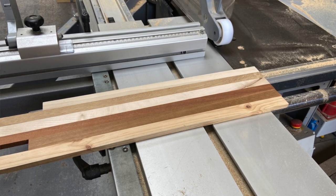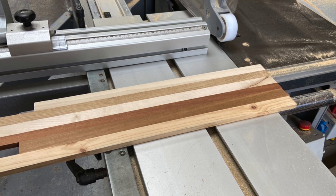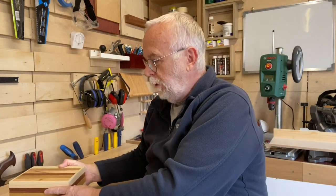Then in turn we were taken to Kaz and Jake's big panel saw, where we chopped the board for the sides into four pieces — and as usual, to maintain the grain running all the way around all four corners. The panel saw was set at 45 degrees to form the mitre, cutting long piece, short piece, long piece, short piece, nibbling pieces in between. So we ended up with four pieces with the 45-degree mitre on each end.